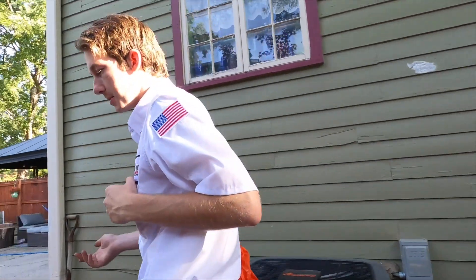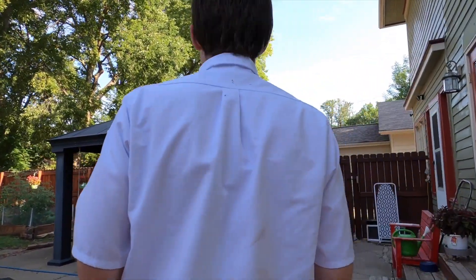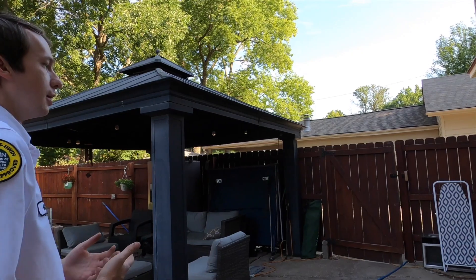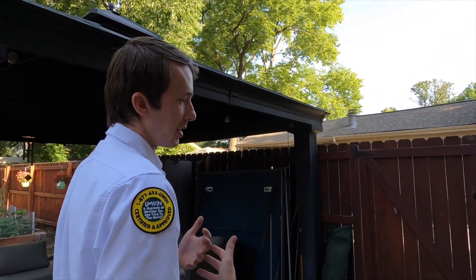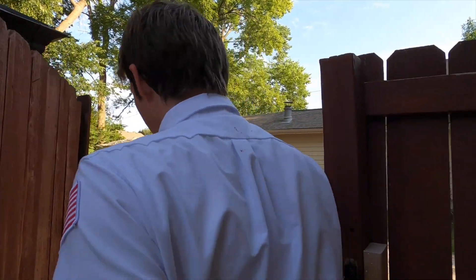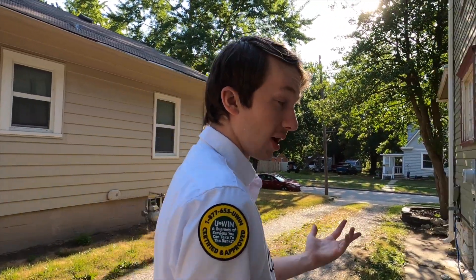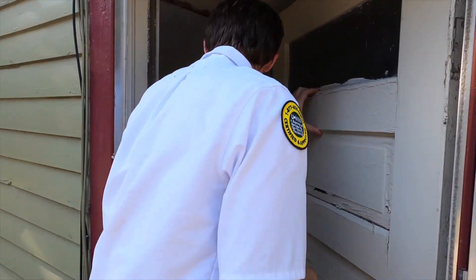With these type of filters that the homeowner has, it's basically an electric air filter that polarizes some of the dust. It's kind of the best of both worlds when it comes to airflow and filtration. But they are a little more complicated to change, and if you do it incorrectly, you can blow a fuse and be without AC for a few hours.